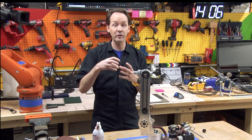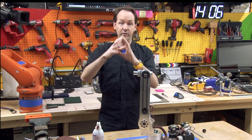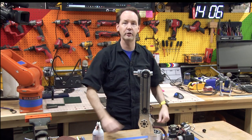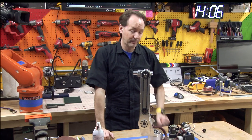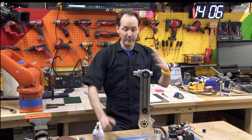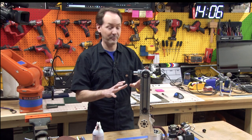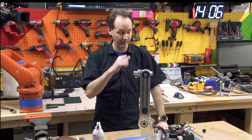They do this in machine tools, like big Cat 50 machine tools, where they heat a thing up, slip the bit in, and then cool it down. That's all you need to hold a really gigantic end mill that's hogging out huge amounts of metal. They do this every day in industry. The problem is once you put it together, in this application, the way this is built, it's not coming apart. Which means if I did it while setting up for this video, I'd get one shot and I'd better be rolling cameras when it happens. And God help the guy at home who's trying to do this and might not get it perfect the first time. So that's not gonna work.